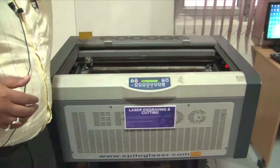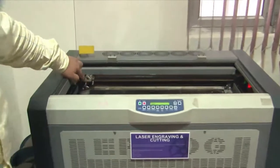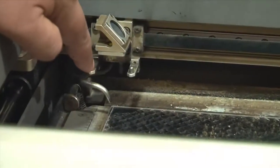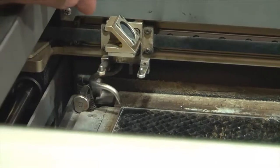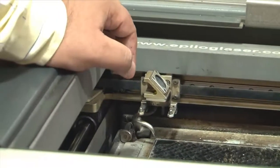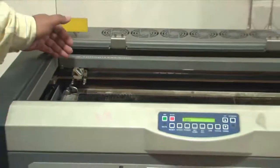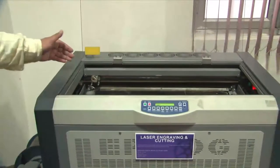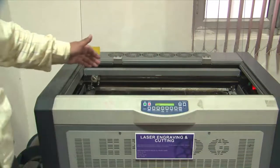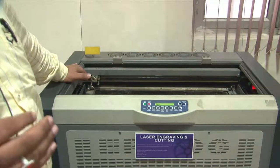This is the machine cover, and you can see on the left upper corner of the system, there is a small lasing head which actually is a CO2 laser, and the head is assisted electromechanically to move like an inkjet printer head on the top surface of this machine and rasters the surface in a line by line manner. So the red CO2 laser spot moves around in a linear, line by line manner, and scans the whole surface at a resolution of about 50 microns between the two lines.